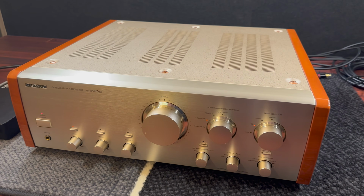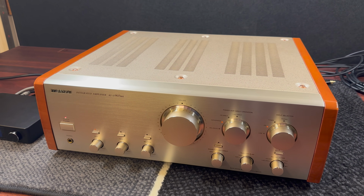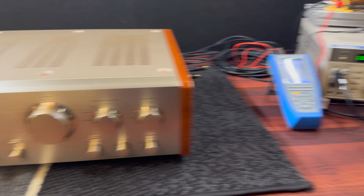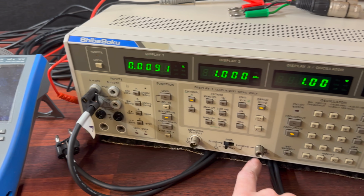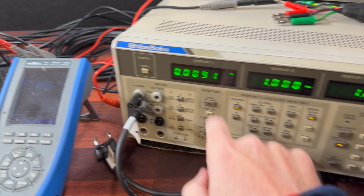There's a lot of gotchas because the positive and negative, but in this case hot and cold side, are both live in their own way. You cannot ground it in any way. You can't join it together. You can't do anything. So I can't hook a scope up. I have to keep the ground floated.